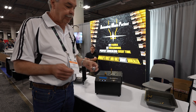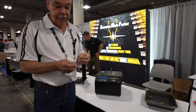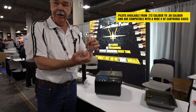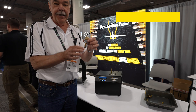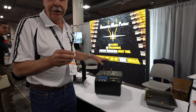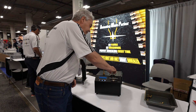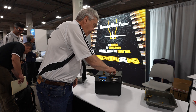Aztec technology is what makes it possible. We have a series of pilots, and the pilot's job is to position the cartridge accurately and correctly inside the annealer so that the neck, shoulder, and five millimeters of the body get annealed. We're annealing 308 here today, so this particular pilot is pilot number 11, which is for the 308 family.